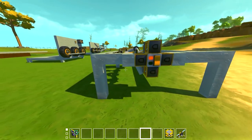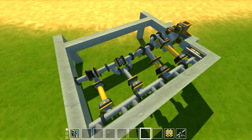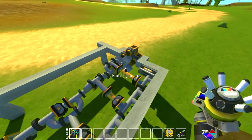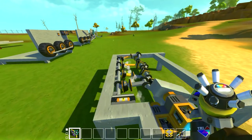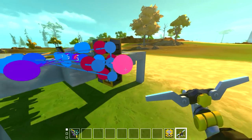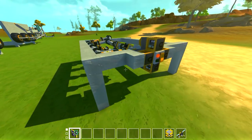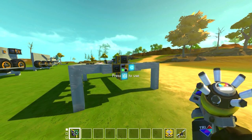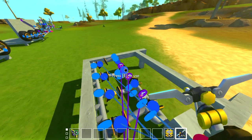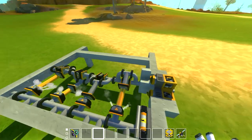With a normal engine, we kind of cheat a little bit, because this isn't really a four-cylinder car engine where it goes two up, two down. It's sort of a 1-1-1-1-1-1-1-1 timing, so they just continuously rotate the beam always in the same direction. If we wanted to change that rotation, I think all we'd have to do is reverse all these angles here in the middle. Oh, no. Oh, yeah. And then, of course, we'd have to reverse all these sensors too, and have all the sensor inputs reversed, or two sets of sensor inputs, but regardless, we could then reverse the direction of travel on this.